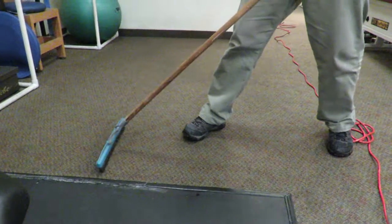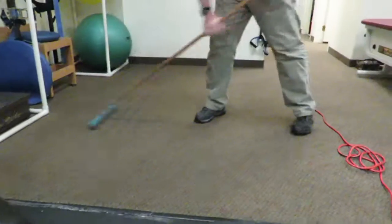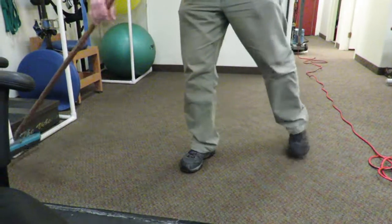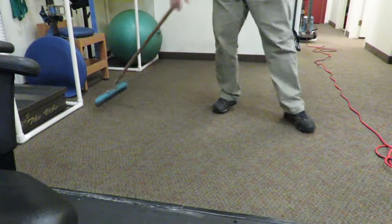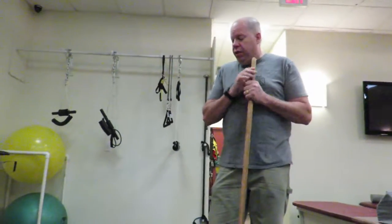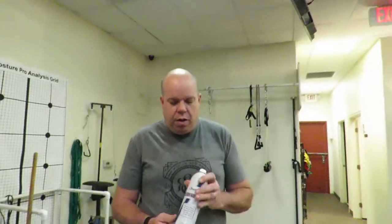Okay, so what you can do is when you're doing a bunch of carpet, just create a zigzag technique. Okay, you're going to use that type of motion. And if you don't like the way it looks with the triangles that show up, you can finish by just doing a pull technique. Now, aside from making the carpet look good with the brush, the real trick is this forces you to inspect the square footage again as you finish the job to make sure you like the way it looks. If you just buff and leave, you may miss something, because sometimes the buffer can hide things.